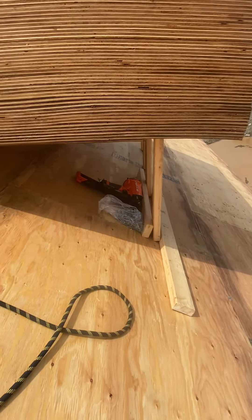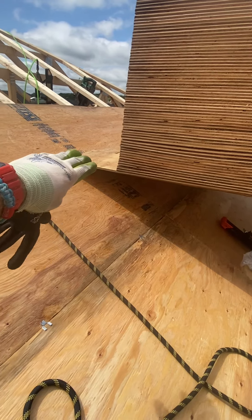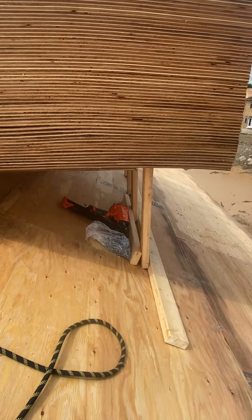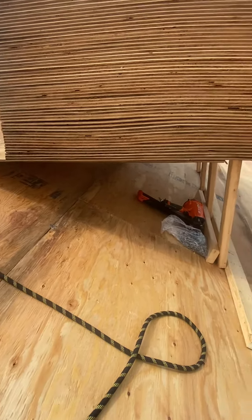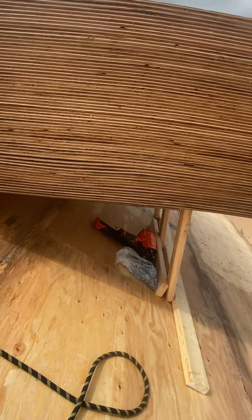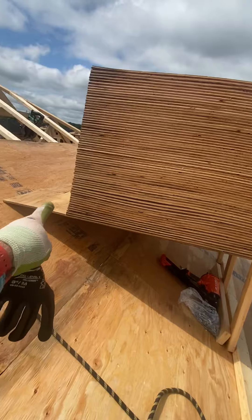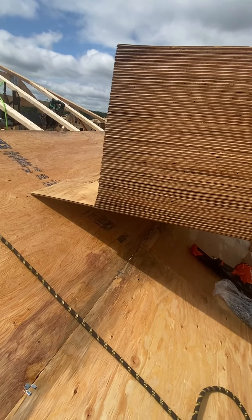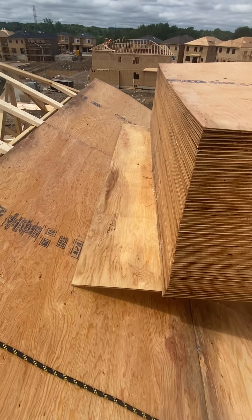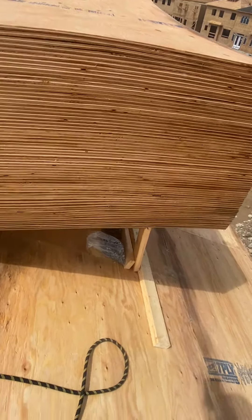After that's in, I put a sheet flush with the outside — flush where the sheets meet the roof — and nail that on. You don't have to go crazy with the staples, just 4 or 5 staples each row so it's nice and stiff. Because I cut it 5 feet, I can keep the sheets back here and that gives me something to walk on — a nice straight ledge right here that I can measure the sheets from. So my feet aren't always on an angle; I get a little break in between.